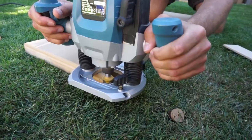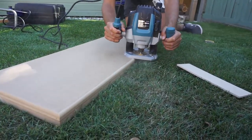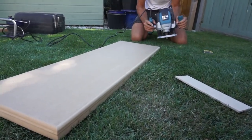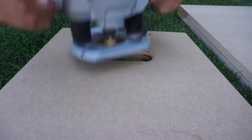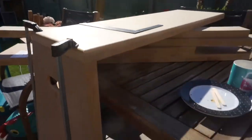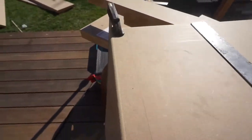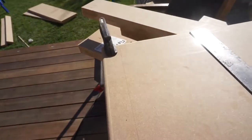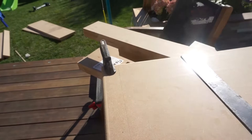We've now got our two side legs and our top ready, and we're going to do a little bit of routing just to make sure the edges of the legs and the top surface are nice and rounded. To join the legs and the top, we've clamped the first leg onto the top, raised the height of our table a little bit to accommodate them, then we're going to mark an equidistant position for four screws. We're using pretty long screws to make sure it holds firmly, and then we'll pre-drill the holes and screw them in before doing the leg on the other side.